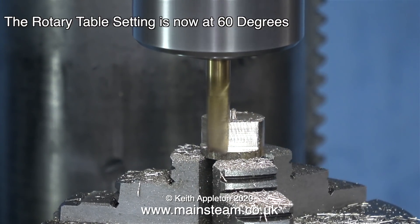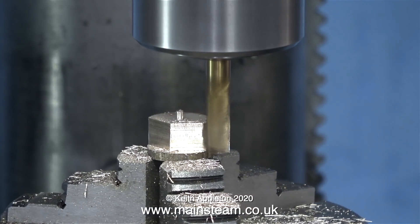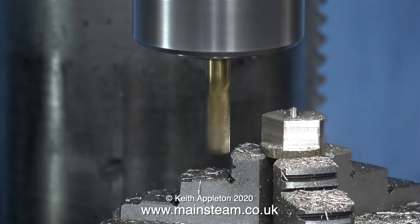Here's a good tip: if you want to machine your own bolt to copy an existing bolt size, all you have to do is put the existing bolt in the rotary table with the cutter stationary. Wind the handle on the cross slide of the milling machine table to move the rotary table closer to the cutter, then make a note of the number on the hand wheel — and that's where you need to turn it to for every cut.